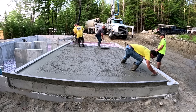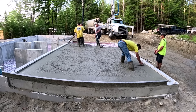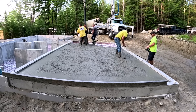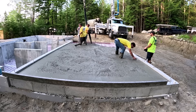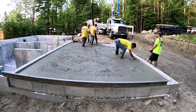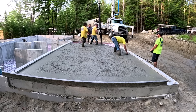We can have a mid-range water reducer or a high-range water reducer, and that allows us to pour the slump a little bit looser than maybe what most people do. It kind of looks wet, but it's really not — it has a really low water-cement ratio, so it's still really strong. We just ask for that at the concrete plant, they mix it up, the truck shows up, and this is what it comes out like. It makes our job really easy.